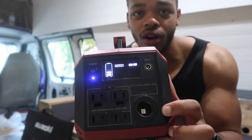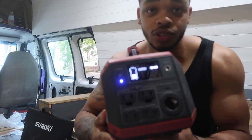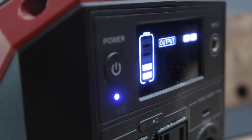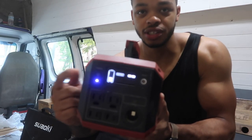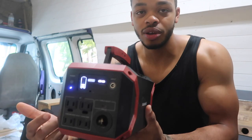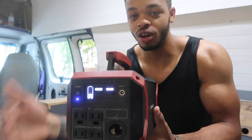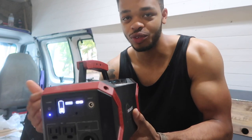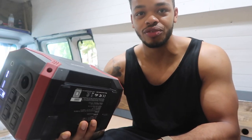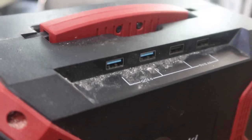I have other videos on my channel describing the difference between pure sine wave and modified sine wave inverters and why pure sine wave is always the way to go. It also has a DC input like a regular car cigarette lighter port, an input for solar panels, and an LCD screen that tells you what you're outputting — how much power you're using and how much is left in the battery. Right now it's about half full because I've been using it all week. Since it's a lithium battery, you can actually run it all the way down with less negative effects than a sealed lead acid battery, and it's only about 15 pounds.